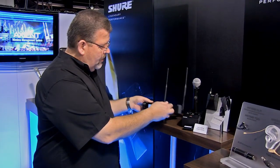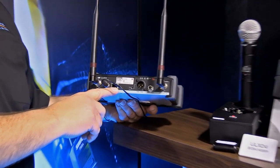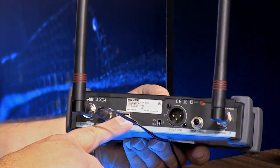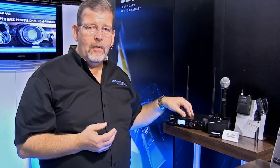The ULXD is fully networkable. All you do is plug in a standard Ethernet connection, the RJ45, use a standard router, and you can connect all of these up. There's software available to monitor them from a laptop. So you've got built-in networking, out-of-range detection, 24-bit audio quality, and you even have encryption. This is encrypted to U.S. government standards — never been broken in seven years, so nobody can listen in on this transmission.